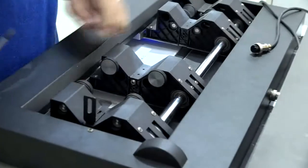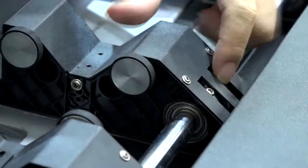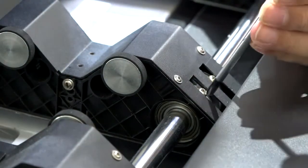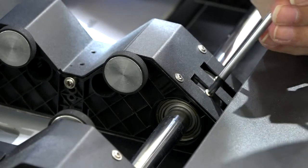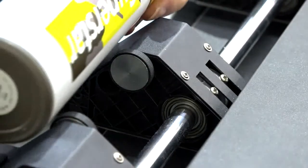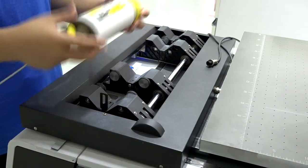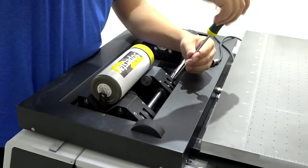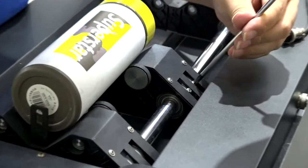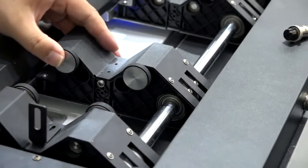For this one, don't move it. For this one, you can move it. First, find this one — you can use these wheels to loosen the screws. Also loosen these two screws. Then you can move this to adjust the position. Sometimes you need to print a long line, sometimes a short one. Once the position is okay, tighten the screws again. Make sure it will not move.